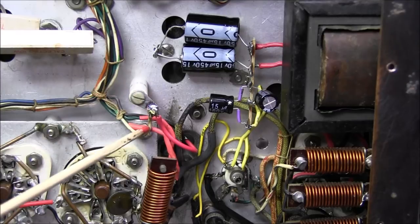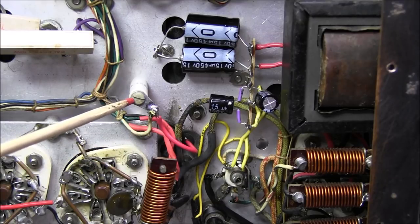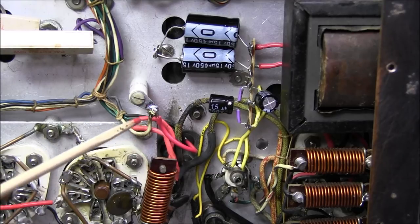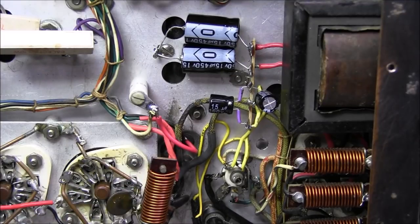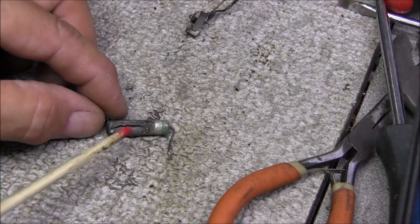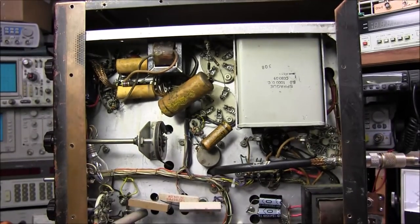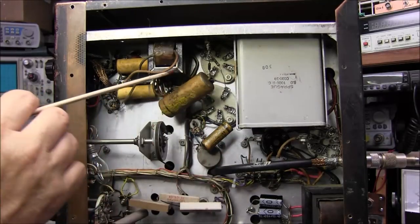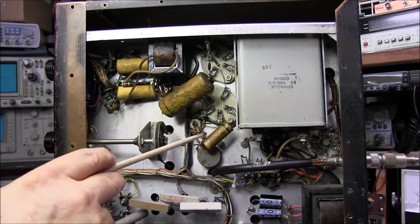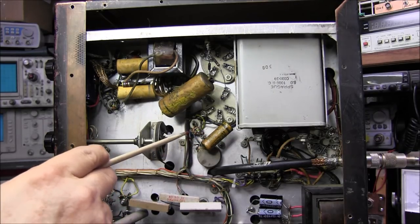I got the high-voltage wire sorted — instead of tearing out all this wiring to replace the whole string, I put a ceramic insulator here and just tied the two points together. To me that looks better than a piece of heat shrink tubing. Now looking at the small RF choke that was under the bigger RF choke — you can see it's completely burnt, and it even has a big long crack in it that came apart when I was moving it. Now I'm starting to clean up this area. We've worked all the way up here and across, and I'm going to start verifying on the schematic if these are the right capacitors and go ahead and start replacing those. There are a lot of solder joints and wiring in here to clean up also.